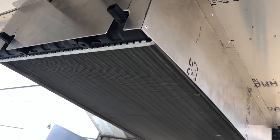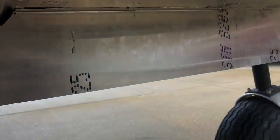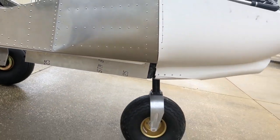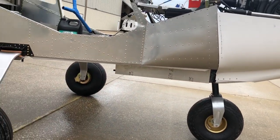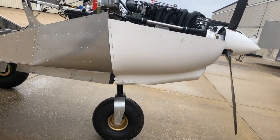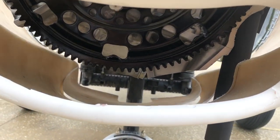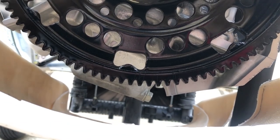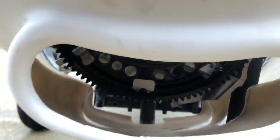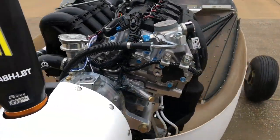The engine needs a cooling system — it's basically just a radiator on the belly, and a sheet metal box around it, very quick to make. As everything gets painted, the line of the airplane goes into the radiator box and it all gets the same color — it's almost invisible underneath there. Cooling air enters the front and goes right into the top of the radiator. Nice clean installation, provides for an open and uncluttered engine compartment.